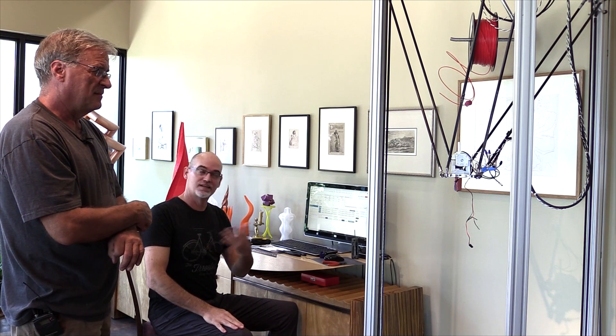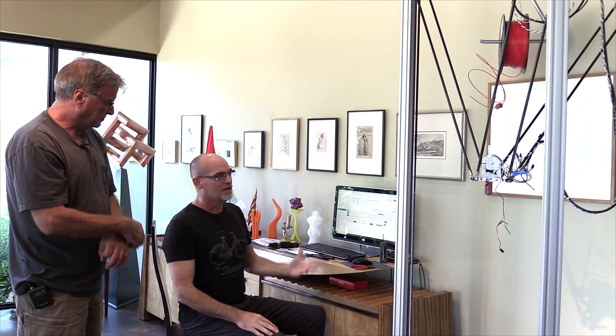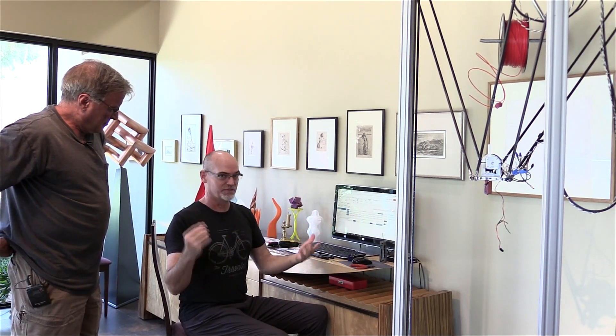Give us some background on what exactly is going on here. Why are you doing these adjustments? One of the drawbacks of the original design was that the extruder wasn't strong enough. When we first started building the system, extruder technology for this size of machine didn't exist, so we just invented something — it worked, but it was very slow. Now people are realizing they can print big things, and commercial products have been designed with much more engineering time invested, so they're better than what we designed.